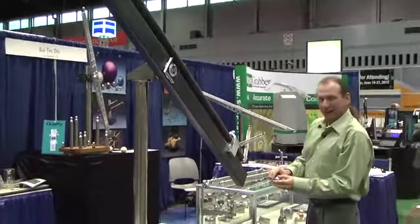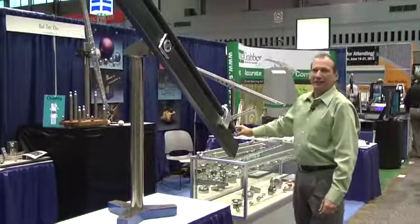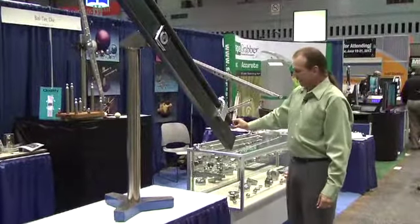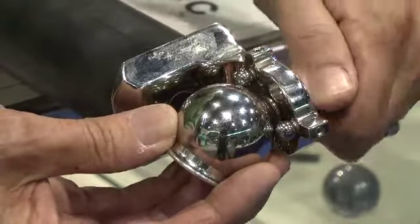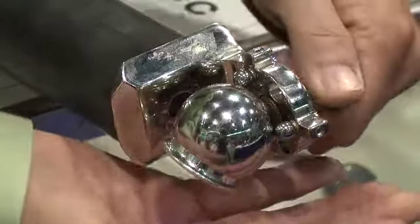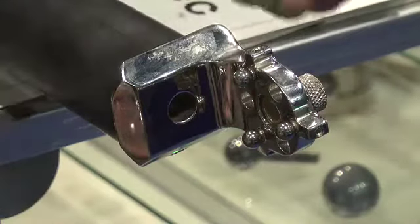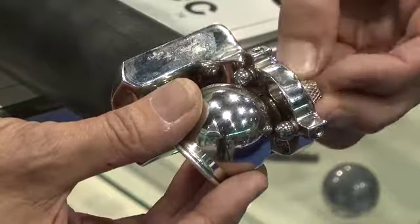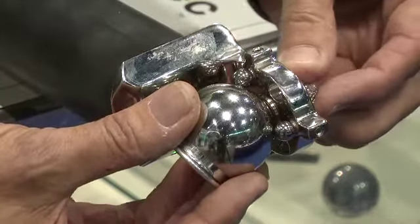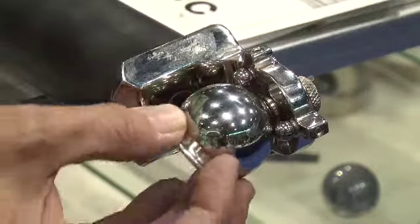The SMR is easily detachable with an adjustable magnet so that you do not have any stick-slip of your SMR sphere. This is an example of how the magnetic preload holds the ball into the nest. As you see, by backing up the magnet, the part simply drops out. There is no force involved until the magnet is advanced into the kinematic seat, and then the SMR is free to articulate.